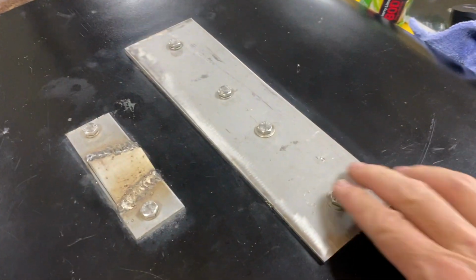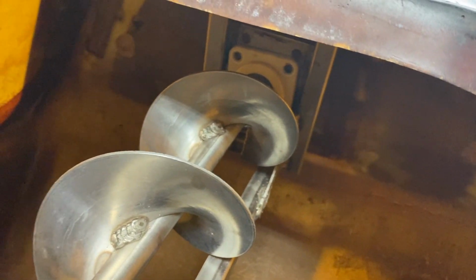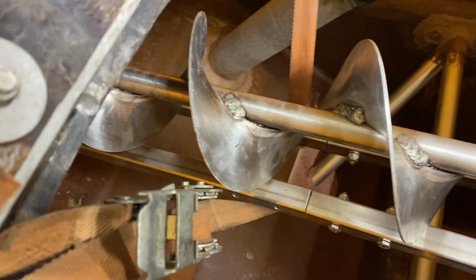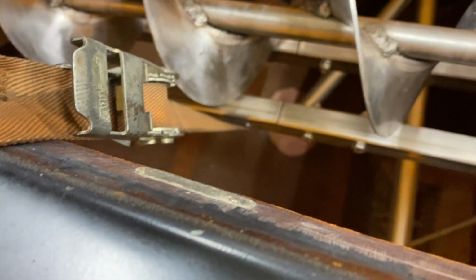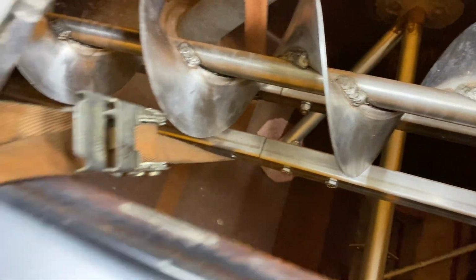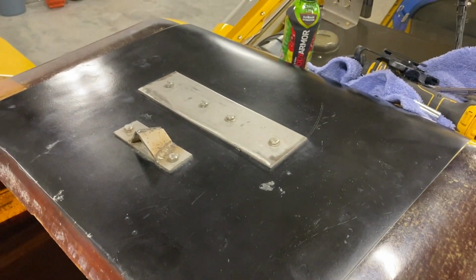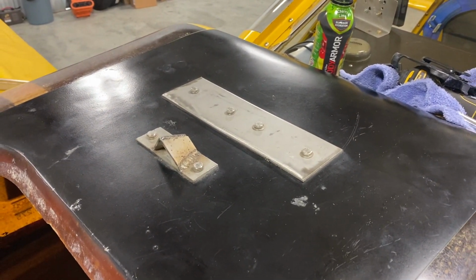Okay, so now this plate, 4 bolts, is supporting the back of the framework for the auger. I've got the auger block loose, so I need to get those 4 bolts out, and we'll see the back half of that framework should come out. Auger in the front half should be supported, hopefully, because I do not want to put pressure on the front 4 bolts up there and crack that fiberglass, so that would be a bad day. So we'll work on getting those 4 bolts out next.